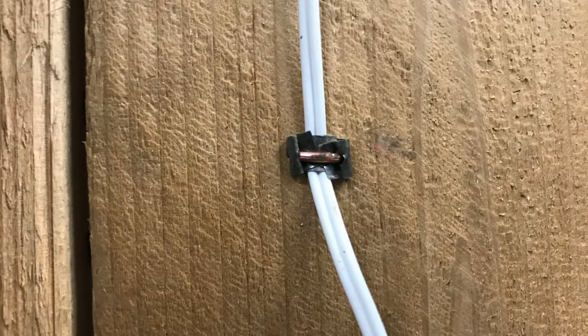After you've looked at the safety sensor alignment, you also need to take a look at the wiring. Check the condition of the wire up and down the wall and ceiling. Make sure there are no staples that have stapled into the wire — it may have lasted for years that way, but through corrosion, moisture, and movement it could now be shorting out. Check your connections on any splices; you may want to remove any tape and re-splice the wires, re-twist them, and get a fresh new connection.